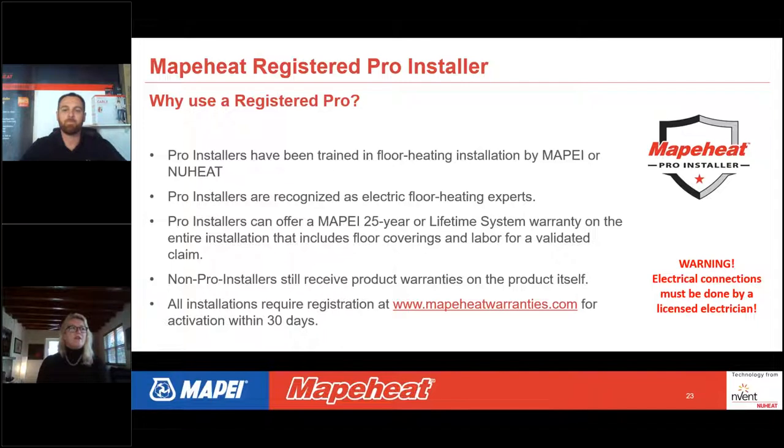In addition to the 25-year warranty, they're able to offer a lifetime system warranty if everything is being put down with Mapei products. So the warranty that a pro installer is able to offer is a little bit more robust than what the warranty would be from a non-pro installer. But non-pro installers are still able to offer product warranties. And once the floor is activated, the warranty needs to be registered within 30 days. As a homeowner or contractor, you would do that at MapeheatWarranties.com. Also, just a warning, all electrical connections must be done by a licensed electrician. So this is a two-trade install.